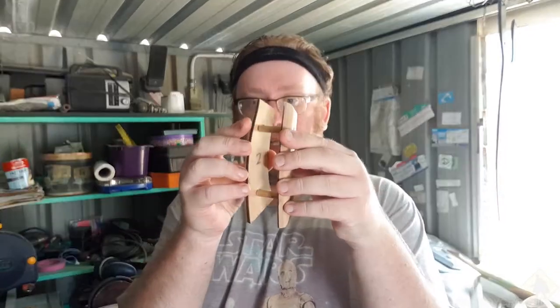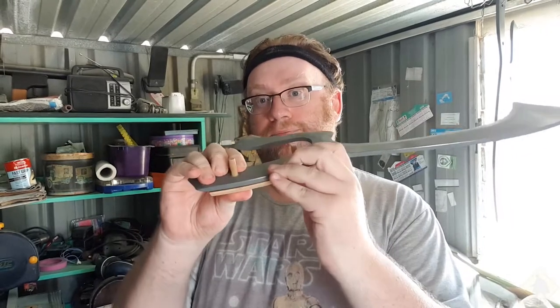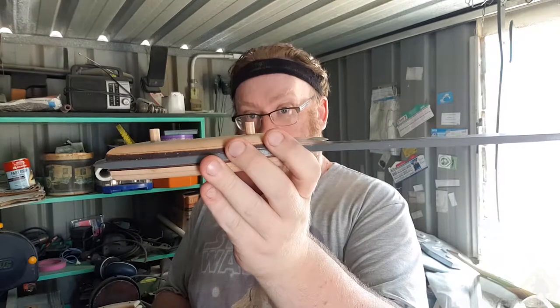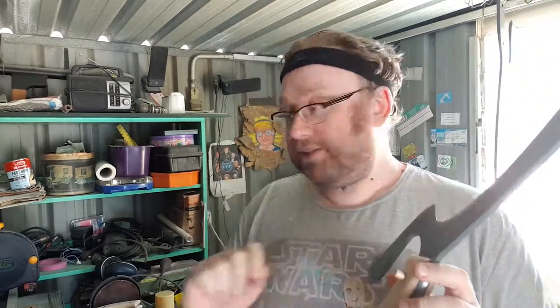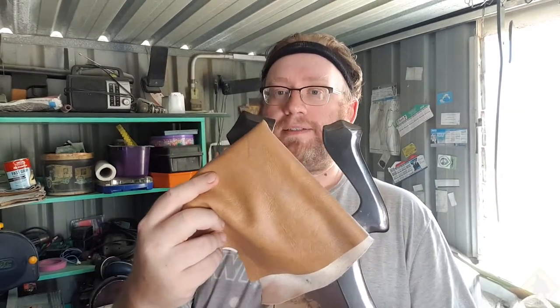However, I have worked on the handles. Basically, a little bit of doweling between the two, that's the handle. So all I need to do is prop these through, like such, and stick these on like that. I've deliberately made them poke out a bit, so all I need to do now is mark where it is, cut them off, or sand them off on the belt sander, and they'll be roughly smooth. And I've got a whole bunch of leather in the bag down there, so I'm probably going to use this leather. I think that is going to nicely offset it.